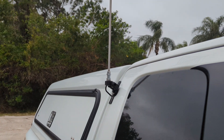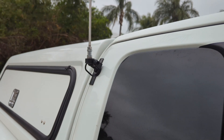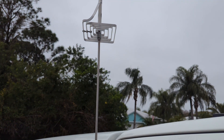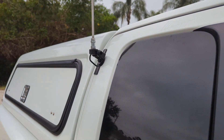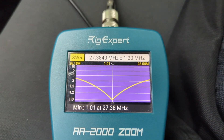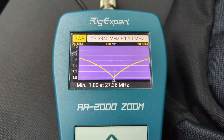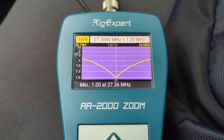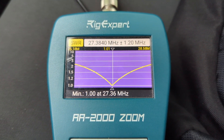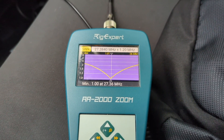I'm going to show you a sweep. What I did was replace the mount — a nice new shiny mount — because when I showed you a 1.4:1 SWR with the old mount, people said 'oh, it's junk, send it back.' They didn't understand it could be the mount or the vehicle or the way I have it mounted. Here is your sweep on the Rig Expert — 1.00:1 right at the lower sideband portion, channel 36 through 39. That's where I want it tuned — 1.00 at 27.36 MHz.